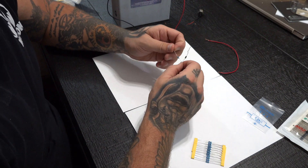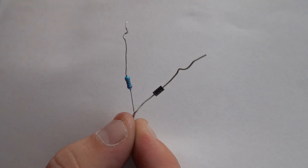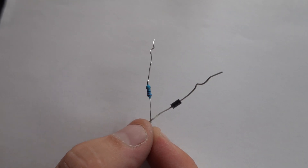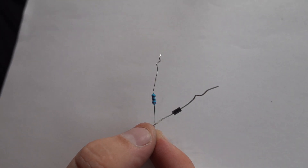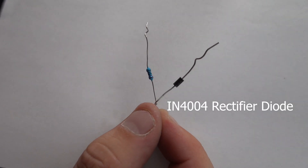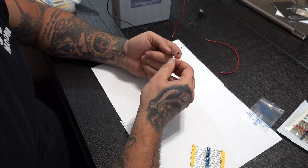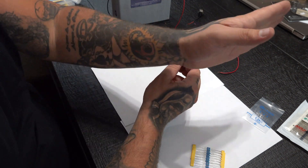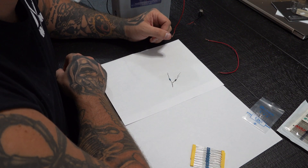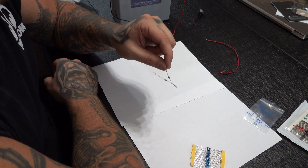So this is the little thing up close. Let me put a piece of paper behind it so you can see it. The little blue or purple thing — I'm not sure what color it is, I'm colorblind — is a 2.2K ohm resistor. And then the black thing is a diode. So the resistor, once again, is bringing down the amount of power, and the diode is not allowing backflow through that Y part of the circuit right there. It's two little tiny pieces — this is probably four cents of electrical components right here.